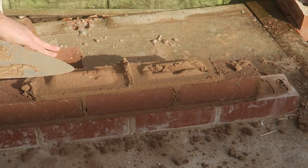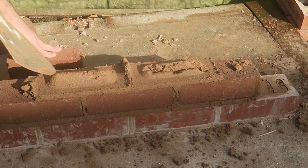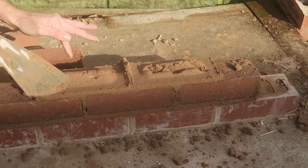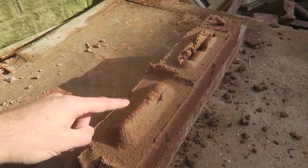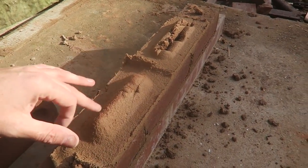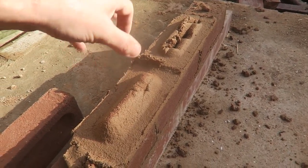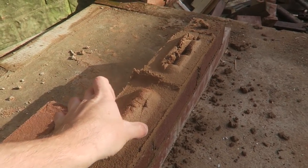This is why I'm saying it depends on how much mortar you're spreading down. You can see that's clearly full — so the pressure going downwards would be evenly throughout the brick, in the middle and on the edges. This frog has been filled here, so the pressure downwards going through this brick would be even throughout the whole brick, and not just on the edges.